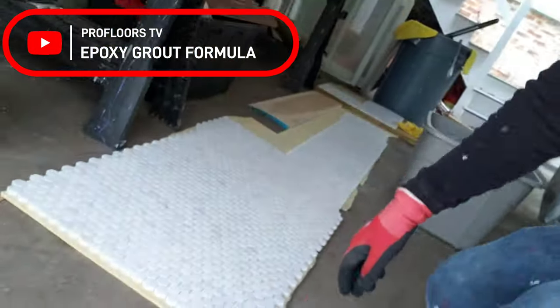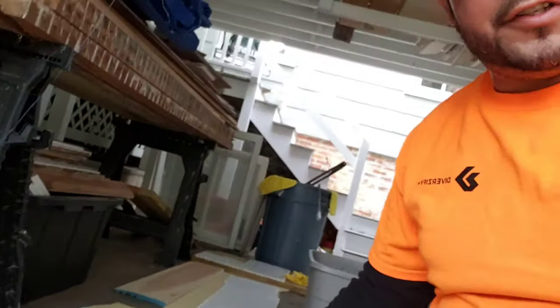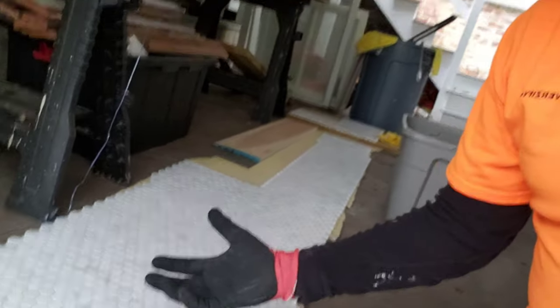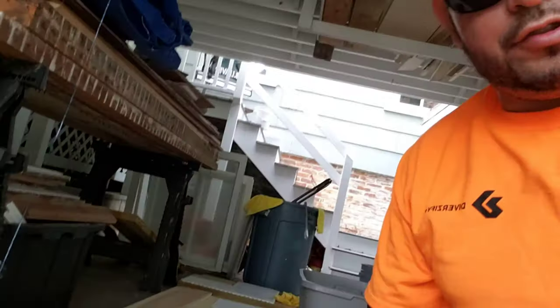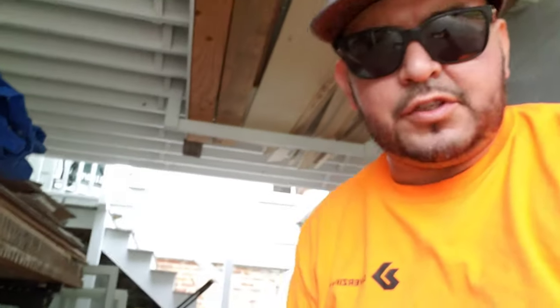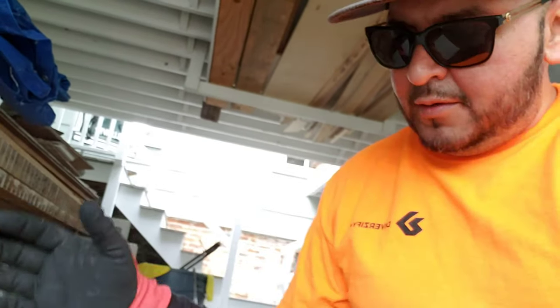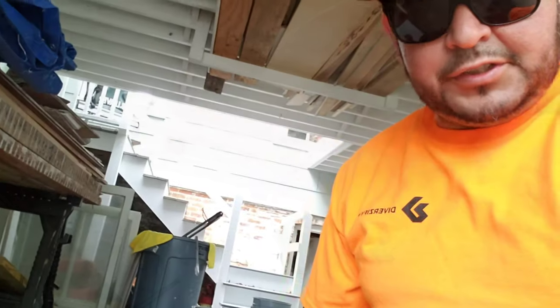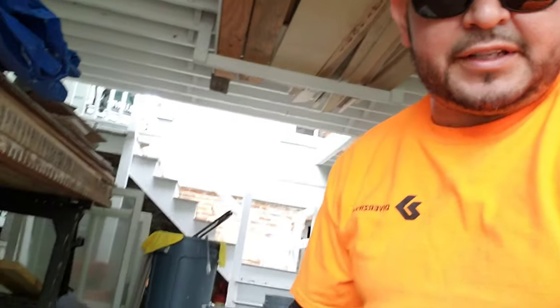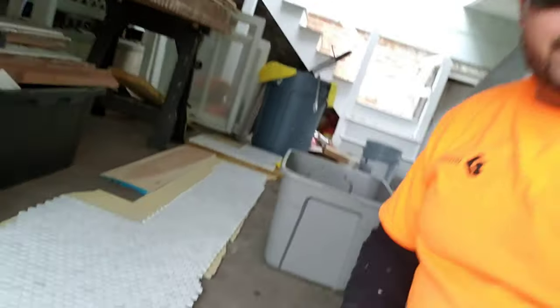As you all see, we laid them out after sealing them. Again, this is to prevent water from going from under the surface of the marble up to the surface — it basically bleeds through. And you can see what stains because it's marble — it goes through. So if we seal it using the six-side sealing method, that will take care of that problem. That's what we're doing, and we'll go up there right now and show you what it looks like afterwards.